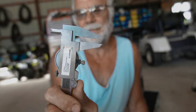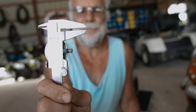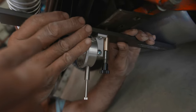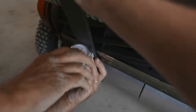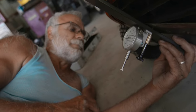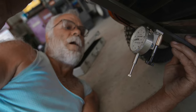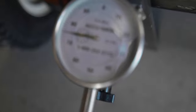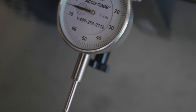Here's where we're at now, and then I'm going to bring it back to where it should be — so that's how much we're going to move, that's almost half. So we're going to pop this off, disengage, slide it up. Now take the magnet off — you just pull it straight out. Whoa, you're whopper-jawed. I can straighten it when I get there — you've got to be perpendicular. Where are we at now? That looks so much different. It's at 175, because it's under the two. So this thing is totally whopper-jawed — maybe that's why it leaves lines. That's exactly why, because it's cut lopsided.